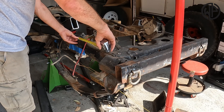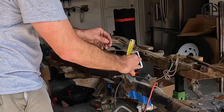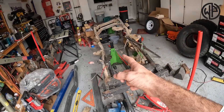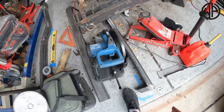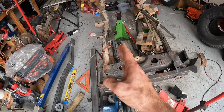With the new frame on top of the old frame, I'm able to measure forward to figure out exactly how far I can go before I want to start angling it up for that better approach angle. And it happened again — this frame is supposed to be on top of that jack stand. What wound up happening is I was tacking and extending it forward, then I needed to move the frame forward in the tape marks to keep it square. Because I was extending it, it contacted the jack stand. In my infinite wisdom, I jacked up the front of the Jeep frame and balanced it on a two-by-four. Not the smartest move.